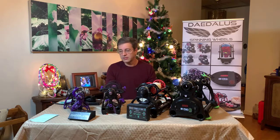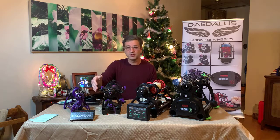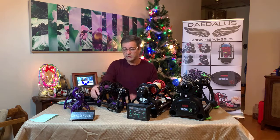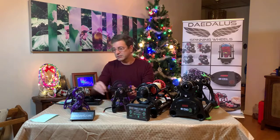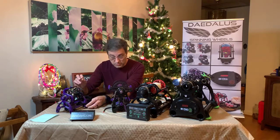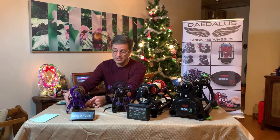How beginner friendly is Sparrow? It's exactly like Starling, because your interface with it is exactly the speed control. You set 40% speed, and like with Starling, I tell you how to ballpark your tension: you rotate the hook to get all the slack out of the belt, and just when the spring is starting to stretch, you can go over and fine tune it with the tension knob on the side. Sparrow is exactly the same way. It has an anchor for the tension belt that you move to get the slack out of the belt, with the spring just barely starting to stretch. And then you've got the same knob and stalk design on this side to control your tension.